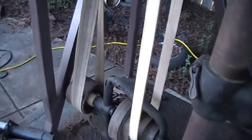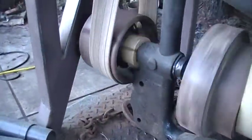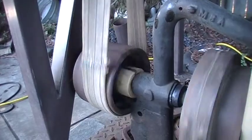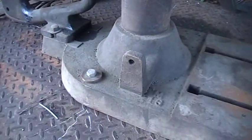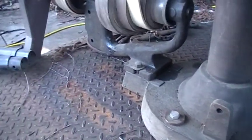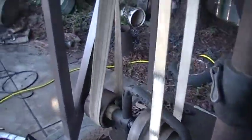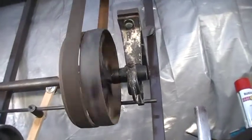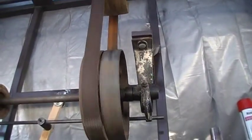I've been making hubs. I made a hub for this little drive pulley down here on the drill press — that's just a little two-piece press steel, which worked all right. All the shifting mechanism for this drill press was gone. It would be nice if I had the foot shifter floor mechanism that bolts on here, but they had taken everything off and put an electric motor on, which I took off and put this jack shaft up here. I believe the larger pulleys will transmit the horsepower a little bit better.